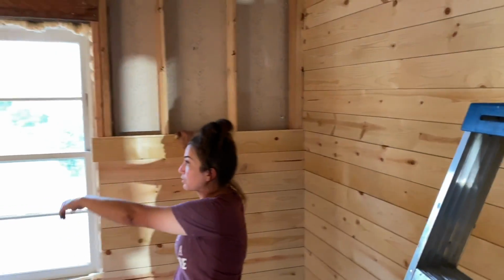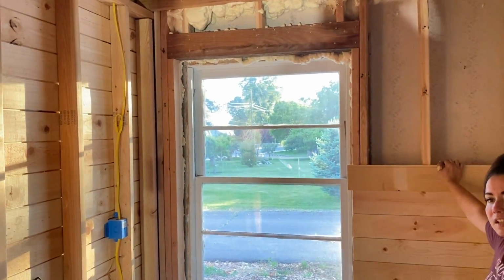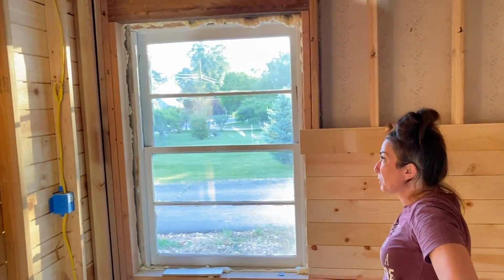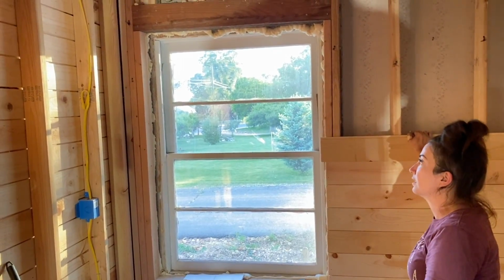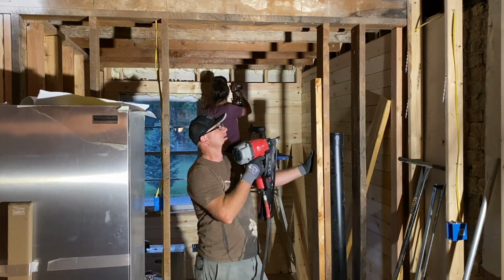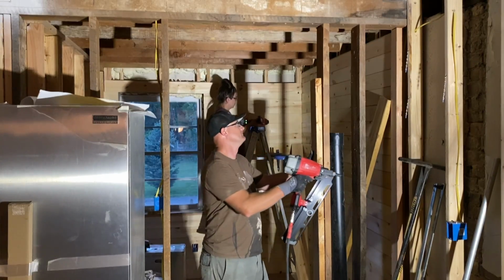I know, you gotta get that extra trimmer in because I'm gonna be up and over and then I'm gonna come down the other side and then I'm gonna do that side. And then you're gonna have to frame in the door. If you get ahead of me, you can cut some of that foam out of there. Well, I could cut the trimmer. I mean, how hard was it to cut a 2x4 and toenail it in? It's not hard. Jamie's finishing the shiplap on that back wall, and I am gonna add the trimmers so we can frame in the door here.